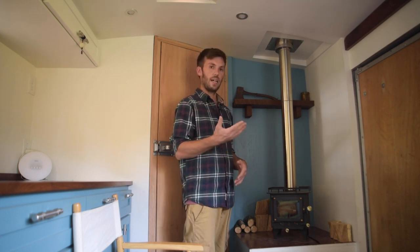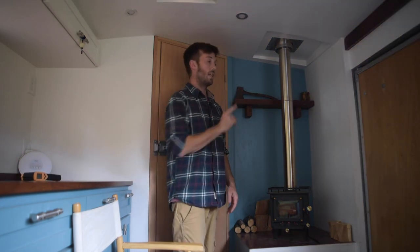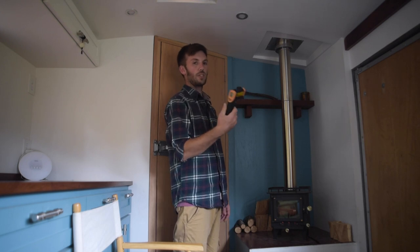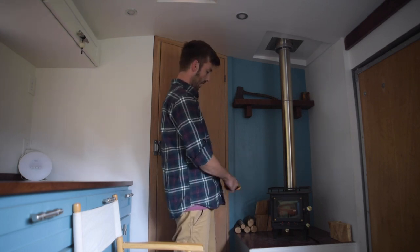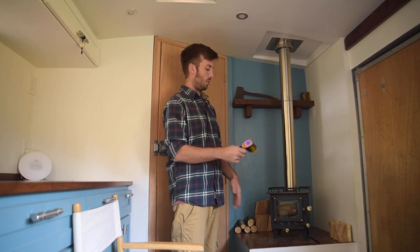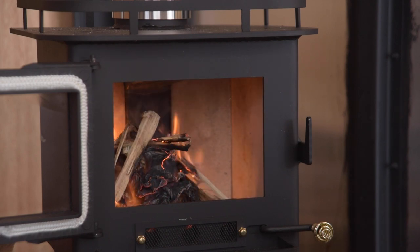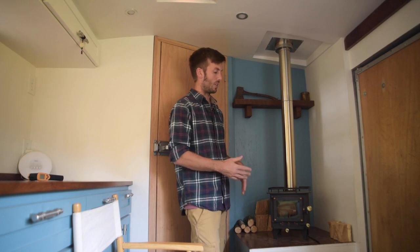If you're going to have a fresh air intake, think about where it's going to be so fresh air can come in through the pipe. One tool I recommend that I use all the time is an infrared thermometer — I'll put a link in the description. Right now the top of the stove is 500 degrees — you could boil water up there. I also use it anywhere I feel like there's a draft or we're leaking heat. It helps you learn your stove, make it most efficient, and keep everything safe so you're not overheating something and causing a fire. This stove is made out of steel and has half-inch fire brick inside, which helps maintain a little bit of heat.